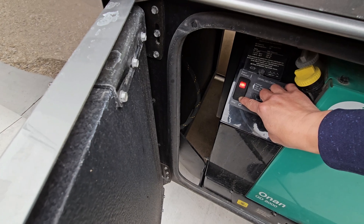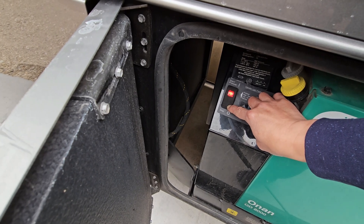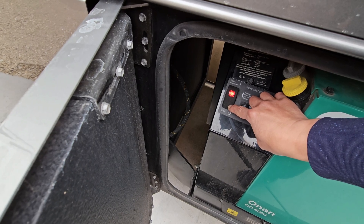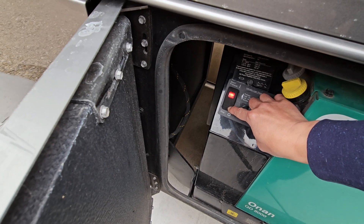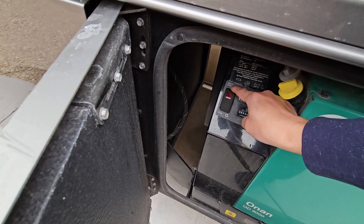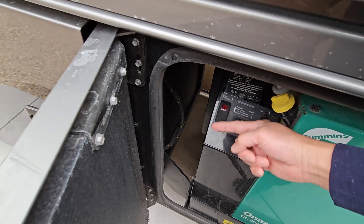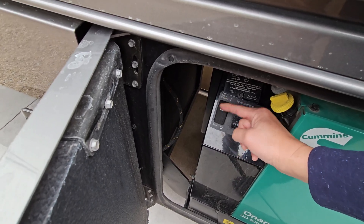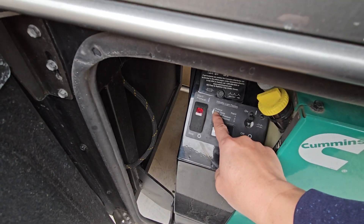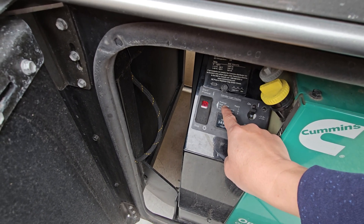This is very important: when you change your fuel filter, or if you ever run low on fuel in your tank below a quarter tank, it's very important to use this prime function. The other function is if you hit the up button and hold it in, you'll hear that clicking — that's not the starter, that's engaging the fuel pump but also doing the preheat. So a diesel generator is going to have glow plugs.